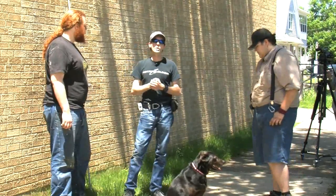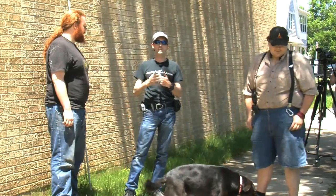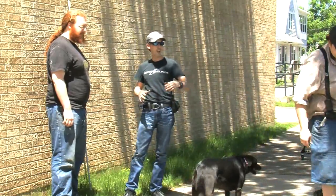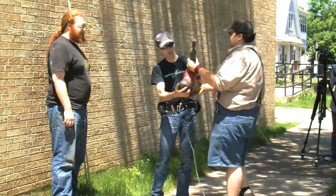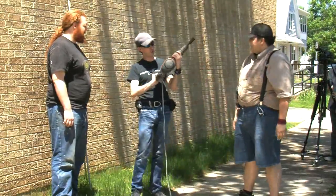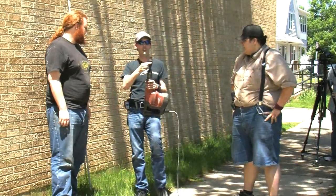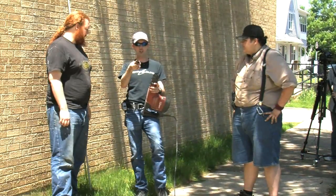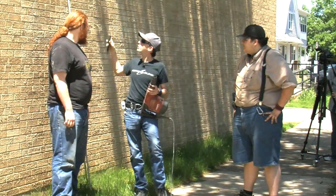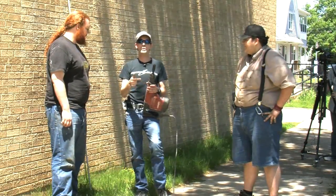Now when you're doing this at home, you'll probably use either a sledge hammer or a slide hammer, and we'll get a look at those — we're going to do some comparisons. Today we had a favor from our friends at the local Hilti outlet. They loaned us a big gnarly Hilti TE76P, and we bought the bit for it. You can buy specific bits for a Hilti hammer for driving ground rods in all different sizes. This is a 5/8 inch ground rod driving bit — you just slip it right over the top, hammer it in, and this is the way you want to do it. You're about to see why.